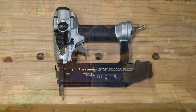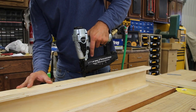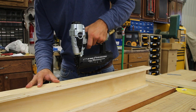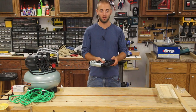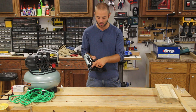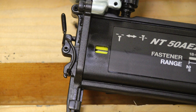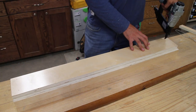Taking a quick look at the 2-inch brad nailer included with this kit — it has a nail capacity of 100. It does not have a dry fire lockout mode, so as you get down to the last nails, it will continue to fire, leaving a piston dimple in your workpiece. I was a victim of that during my testing. At the front of the magazine there's a little window, and when you're out or getting near out, a yellow plastic piece will show up notifying you that you're low or out of nails. The lack of a dry fire lockout is a big drawback of this unit.